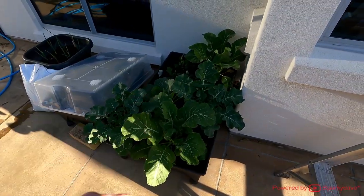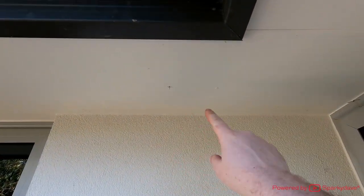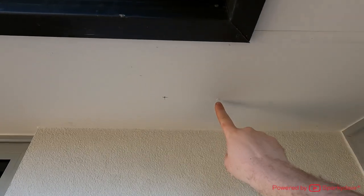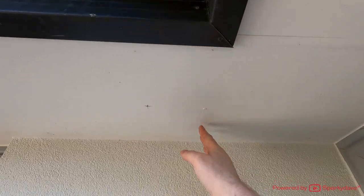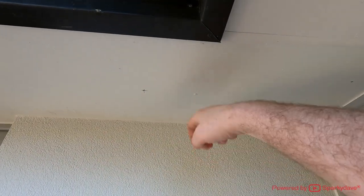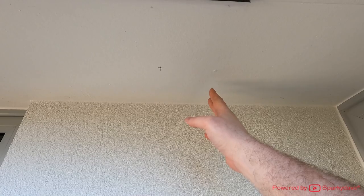Need to relocate these portable veggie gardens out of the way. What I've done here off camera is identify firstly where timber features in the soffit. If you look for nails that have been painted over, that dictates where the timber runs perpendicular to the wall. You can knock on it and you'll hear a solid noise behind the nail, and if you knock away from the timber you'll hear a hollow noise — and that's where I want to cut into.